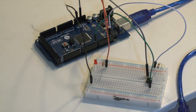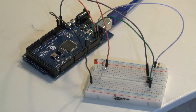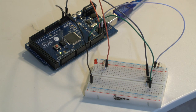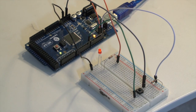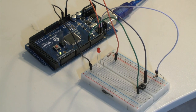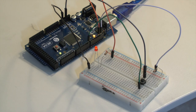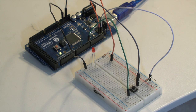The Arduino has been programmed and should work appropriately — let's just plug it in. It now has some power. That blinking was just the initial surge of power. The button is right back here — if I click it down the light comes on and stays on until the next time I press the button, and then it's off. That's a nice little way of making a button into a switch: turn something on and leave it on, then turn it off and leave it off. There's the demonstration.